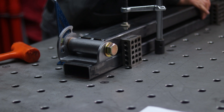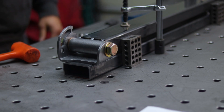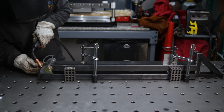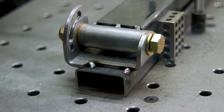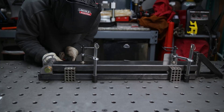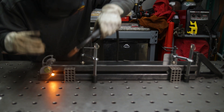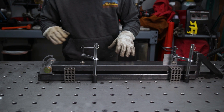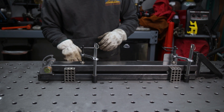Clamp it all down. When you clamp it down and if you cut the tubes correctly, you should have about a quarter-inch clearance here. Let's tack this guy in place. I like to tack everything before I completely weld it, just to ensure fitment — if something's off I can always break the tacks off. We will fully weld this in later down in the video.